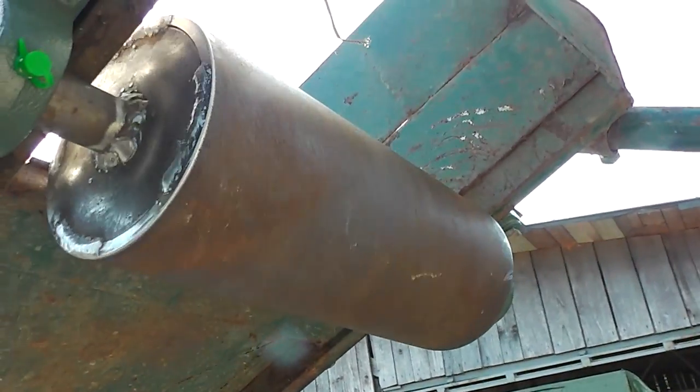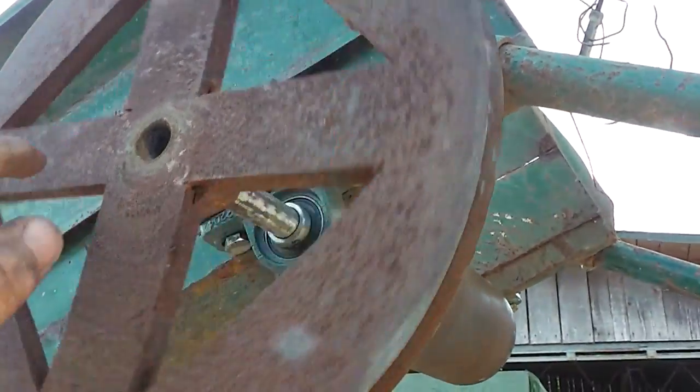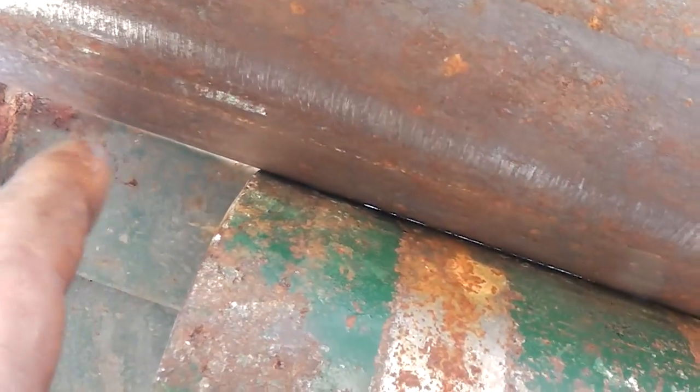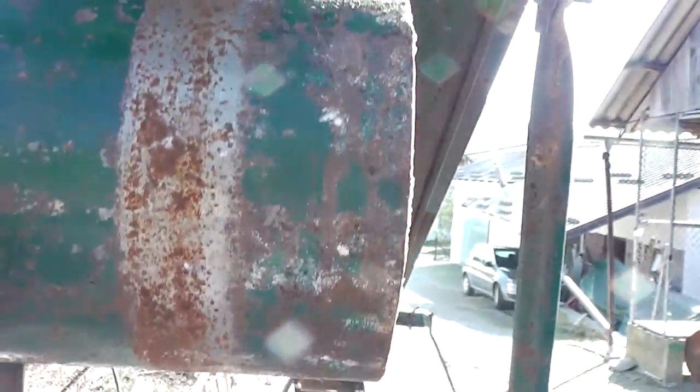There you go — the shaft is in place with my homemade pulley. You can see it does not move left and right; it is very centered, perfectly. Let me show you the old piece. The old piece was here in the middle — you can see the corn always got stuck in between, so the belt and transporter stopped. Now you can see we increased the full length; it is covered from side to side, so the corn cannot get stuck here anymore.